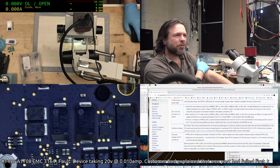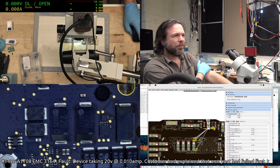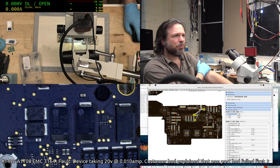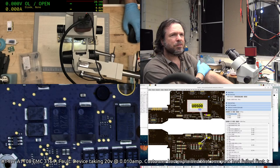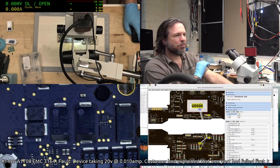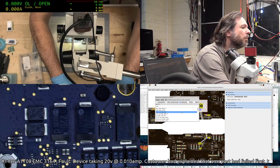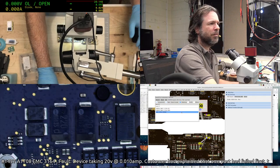All right, so let's see. Check for low resistance on SM bus ground. Okay, this is the clock and data lines. I believe I did check these ones. I think they're the battery ones. SM bus, SMC, I'll just do SMC underscore 5. I'll look for that. SMC underscore 5.